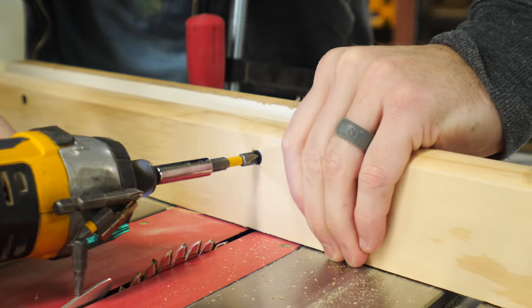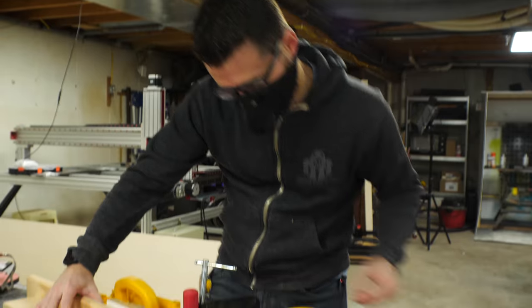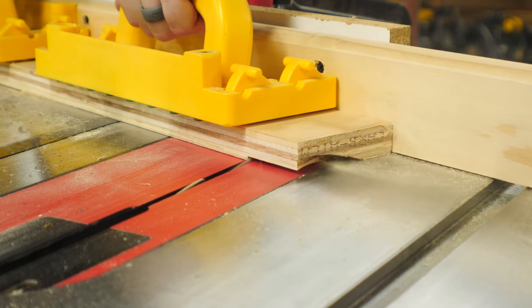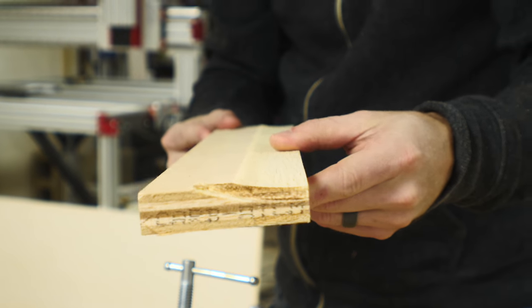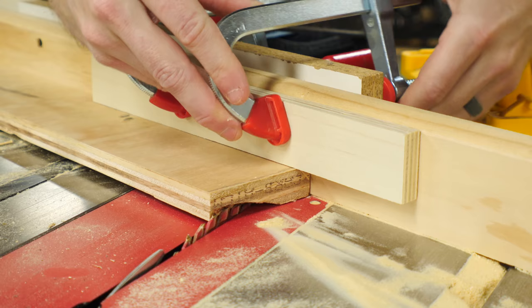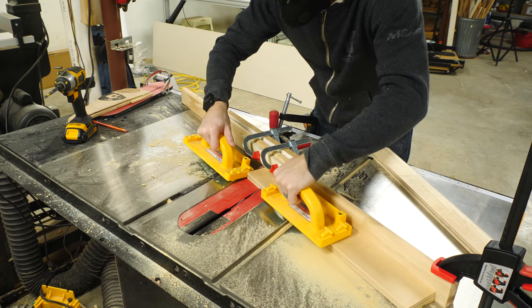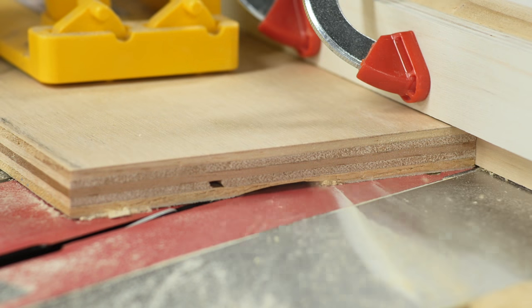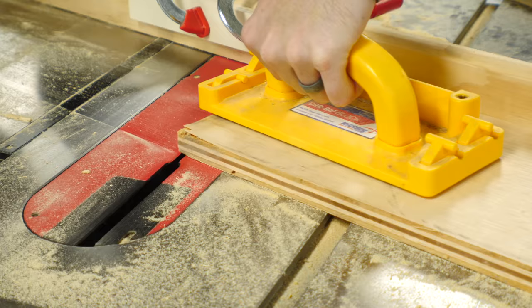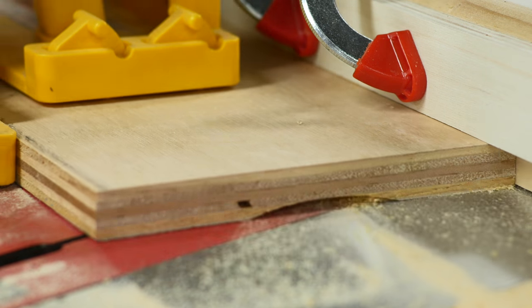Usually people clamp down a board to the table saw, but I used my miter gauge and extended its reach by screwing on another piece of wood. I also clamped the end of that down so it wouldn't flex as I pushed over it. On my first pass I realized the blade was way too high, so I backed it off and worked up to the height I wanted. The piece had a tendency to pop up, so I added a guide on the back side to stop it from moving up. I tried a different piece next and it worked better, but I realized it needed to be supported on both sides of the blade, so I got a much wider piece and ran it over the blade for the next test.